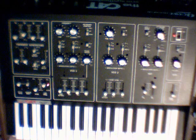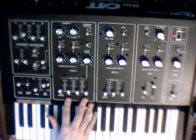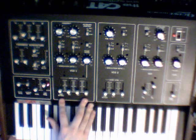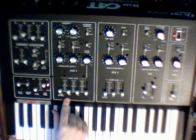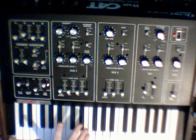This is the demonstration video I'm obviously referring to. The first thing is when I went through the VCOs — that's here and here — I didn't actually mention each VCO has its own sub-octave. That's what it's actually called, but it basically is a sub-oscillator and a square waveform, and it plays one octave below the rest of the waveforms in the VCO, and it's clocked to the same frequency.